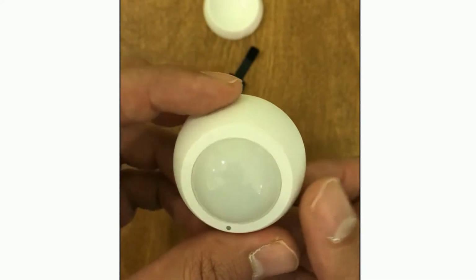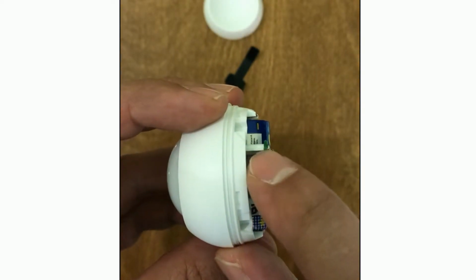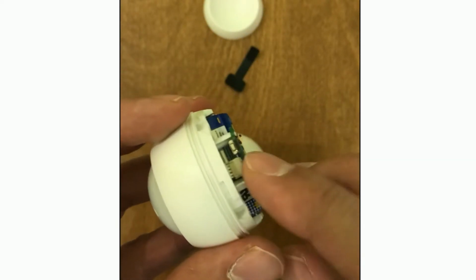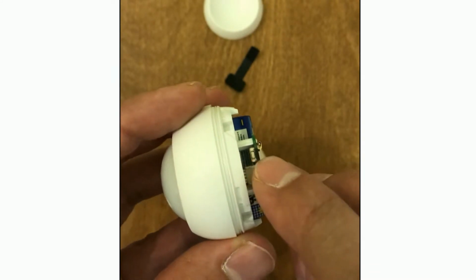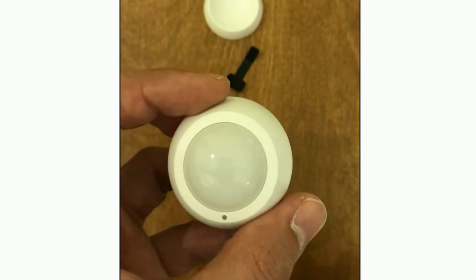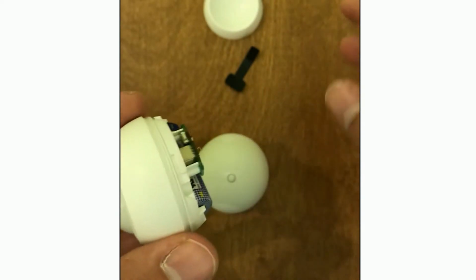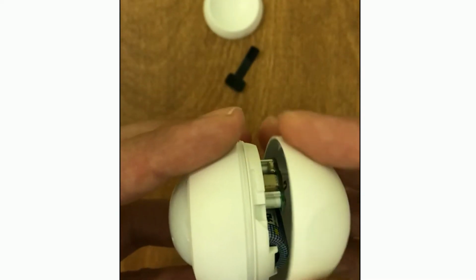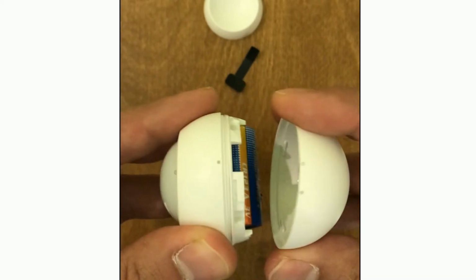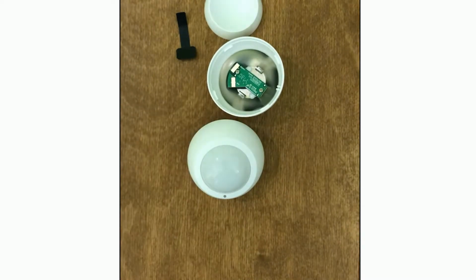If the auto inclusion period is finished or the Z-Wave button is pressed during this time, in order to add it to the Z-Wave network, have your gateway in inclusion mode and press the Z-Wave button once, and the PSP05 is added to the Z-Wave network. Let's add it to the Vera control unit.